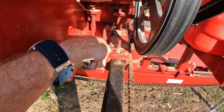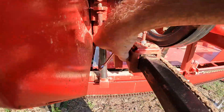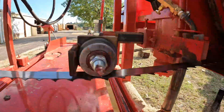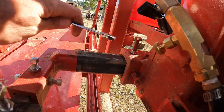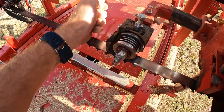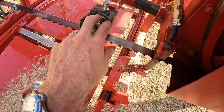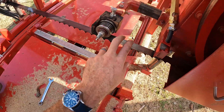We're going to go through and loosen up all the jam nuts. We've got our jam nuts loose and we're going to get these bolt heads loose. Now I still do have tension on this blade, so that blade is good and tight — we're going to take tension off of that, so whenever we tighten this back up we are not pushing on that blade. Because you do have down pressure on that arm picking it up, and especially now that we've got it loose, that blade is certainly going to be picking that arm up. So let's go ahead and get that tension off of the blade.